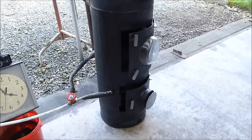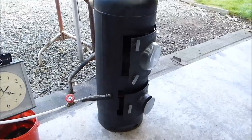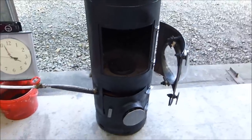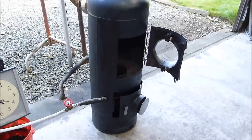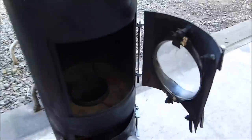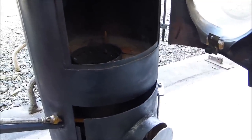Last night I had some solid fuel in it — some logs and various other bits and pieces that I just threw in. I wanted to see what the output would be like, to see if it could match the output of the oil. It gets pretty close. It was over 1000 degrees Fahrenheit last night on the side walls at the top end of the stove. The burn chamber runs from here up to the top, and that whole section was over 1000 degrees.